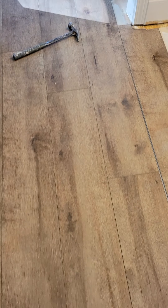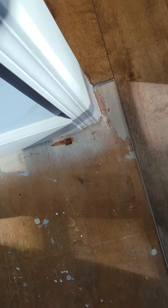I want to show you the best way to get your floor under a door jamb. I'm running this direction right here, and I was able to get this one under because I had room to lift it up and lock it in. But I wouldn't have that situation over here, so what I did is I laid out my joints so that when I get to the door jamb I can do a seam anywhere in here.